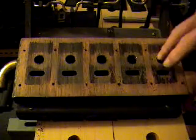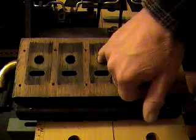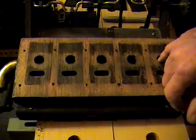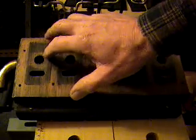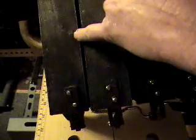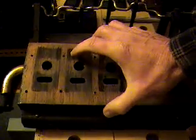The next thing I'm going to do is check the integrity of this air channel. I'm going to seal all this off with a piece of tape and then test whether the air is sealed, because this is supposed to be a sealed chamber in here — this whole area is covered with shellac or some sort of sealant on the inside. What I've found over the years is that the wood they used was not well enough dried, and it cracks. Air is actually leaking internally through the wood and out the back of the motor — right through the wood and out into the atmosphere. We're going to check and find out if that's the case with this motor.